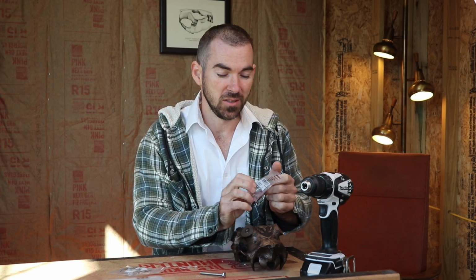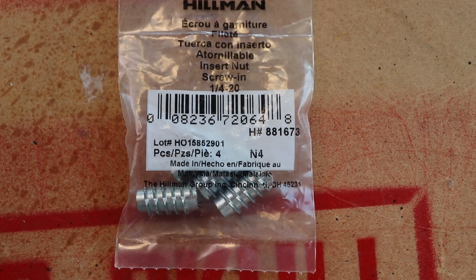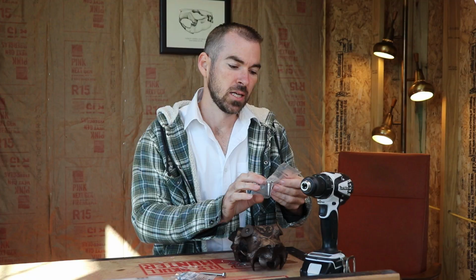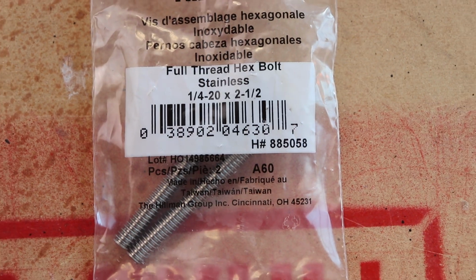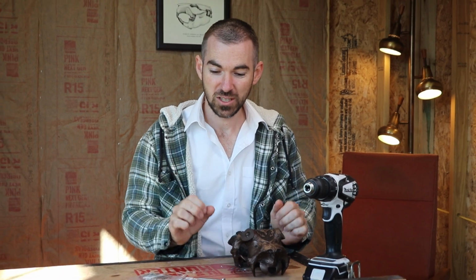The products that you'll need to mount the antlers are these insert nuts, which are 1/4 inch, number 20, and a full thread hex bolt, which is also 1/4 inch, number 20. I will leave the specifications and links to these products in the description of this video, so you'll have exactly what you need and the measurements for the drill bits that we will use. So don't worry about that, you'll have all the information that you need, but these are the two products that you will need to buy in order to use this method.